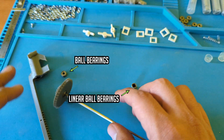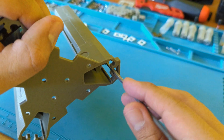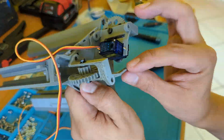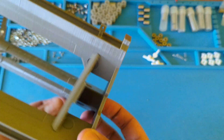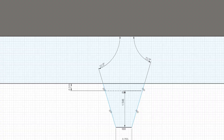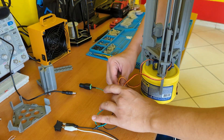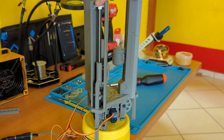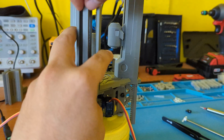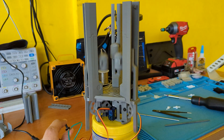If I'm getting too technical, let me know in the comments so I don't go too deep into these details. Time for the most important test of the project. This right here is the base where the three pistons are going to move. I find the base where the rail of the pistons goes to make the movement a little bit easier. Cut the steel rods to size, assemble the three motors and also the pistons. The screw will go through the base and reach the center plate to reinforce the whole part, since there is a gap between the gear and the rail of the piston, so I will update the design and reprint. I believe there is too much contact in the gear. Now to disassemble, file the teeth of the rail and the gear, reassemble. Yes, perfect.